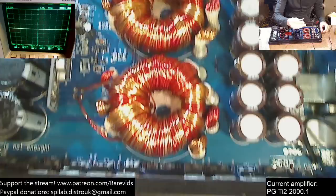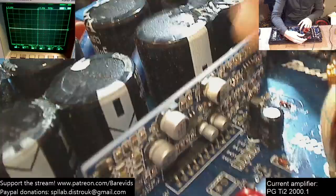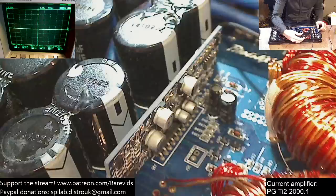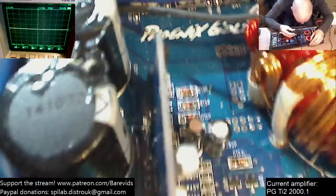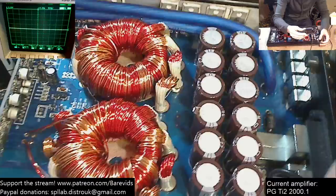Here we have the power supply circuit. Power supply circuits in the majority of car audio amplifiers are very generic and pretty much all the same — no difference here. This little driver board is used in something like 85 to 90 percent of Class D mono amplifiers of this power type. For the power supply MOSFETs we have IRF 3205s — a pretty standard and very good MOSFET for this application. Very reliable, easy to drive, good current handling. Thumbs up on those.